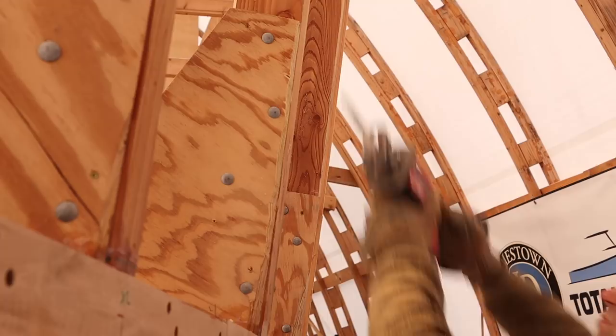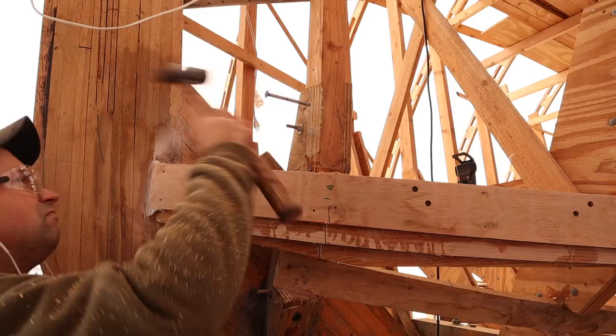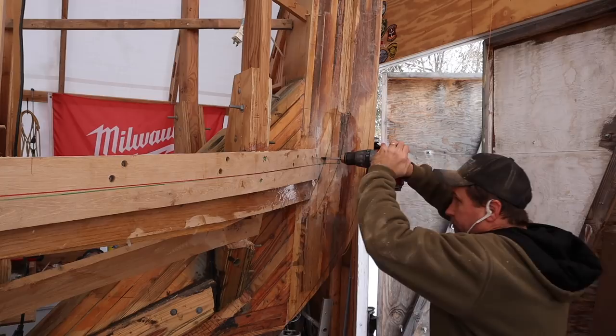And that involved adding some bolts to the raised shear section of the aft part of the boat, cutting off pieces of the gusset that were going to interfere with the planking, reinstalling bolts that I had taken out to facilitate installing the chine, and on it went. Added a few more screws to the chine itself to tie it to the knee, and then we moved on to start laying out where the actual chine was going to fit.